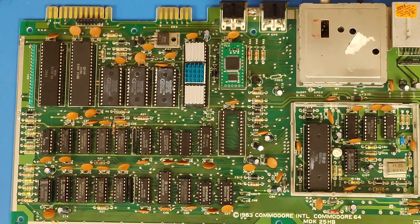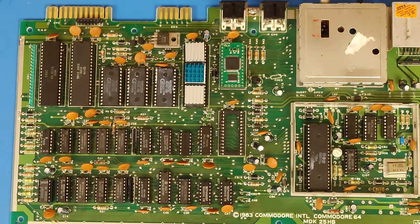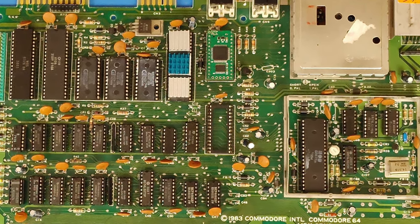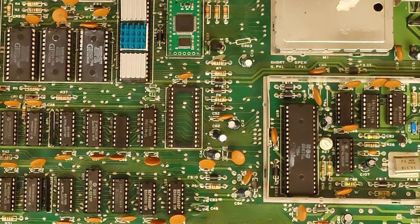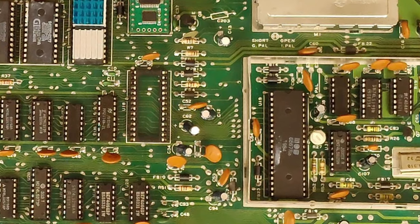So I am going to remove each of those resistors and test them, and put brand new ones in their place. I don't know if that's going to affect it — there's something on this board that is only very slightly affecting everything, so we'll see if this helps. Just a quick note: I decided to keep C12 the same as what it is on the board. After reading some online discussions, it turns out that the early runs of this board had the electrolytic cap and the later ones had the ceramic one. So as not to upset things, I'm keeping it as is.